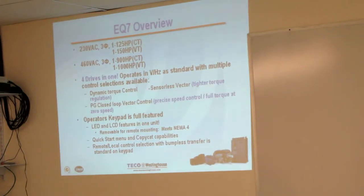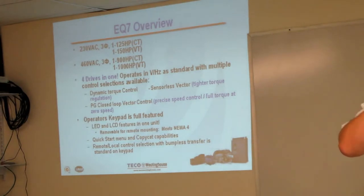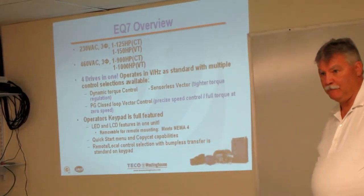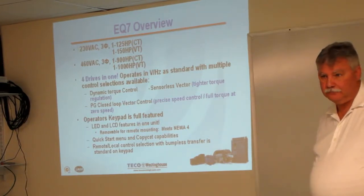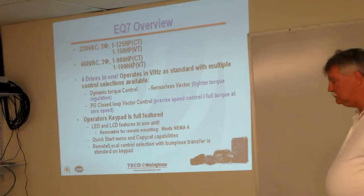Question: Do you supply grounding rings on your motors — are they special order or standard? We can modify and put them on; we do that all the time. Down the road later this year, I think most manufacturers are going to add grounding rings to all motors as standard because of the direction drives are going in the future. But yes, we can add them — it takes a couple of days and it's no problem. You do have to specify grounding rings, but we can get them out quickly.